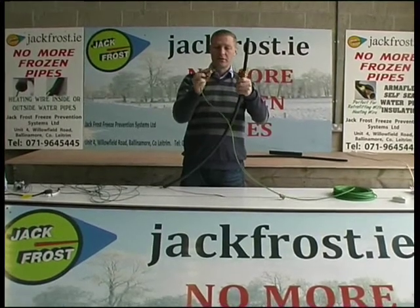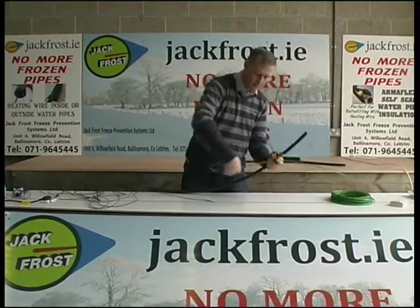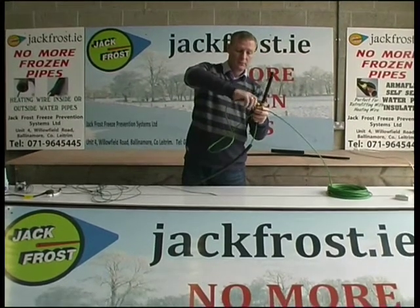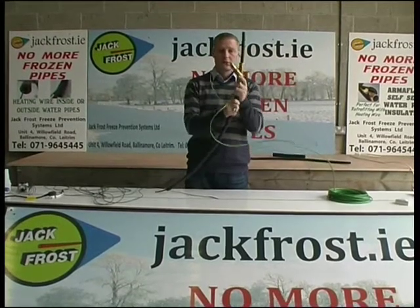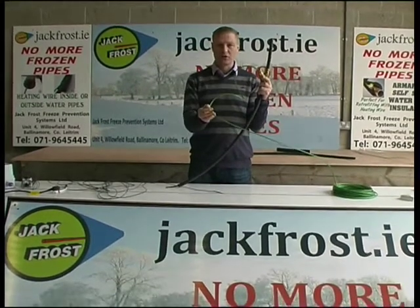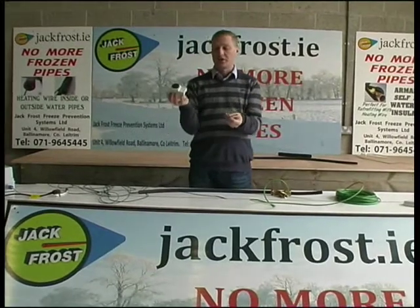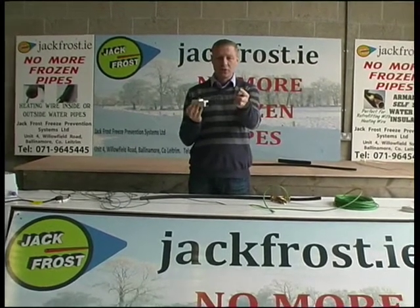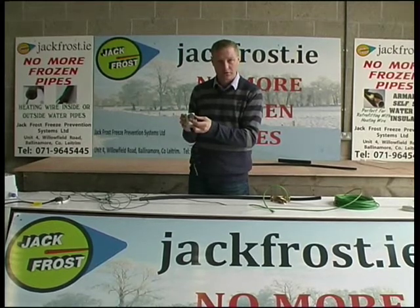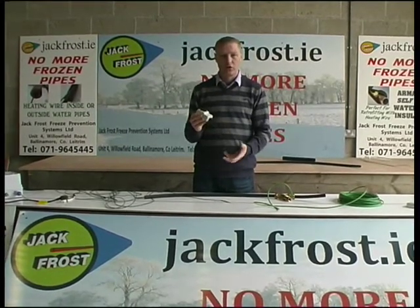Get a little bit of plumbing tape and you seal up this fitting onto it. You push the rubber in there, then the washer and the fitting goes in. Use the tools to tighten it tightly — it's a seal joint that will not leak. You simply put this wire onto a frostat. There are two different types of frostats. With this frostat, which is under your sink in your house, it has a probe which goes out through the wall and reads the temperature outside. You set the frostat for freezing — minus five, whatever setting you want. Your system will only come on when it freezes. Simply take the second wire from the frostat, your three-pin plug, and plug it in. No more frozen pipes.